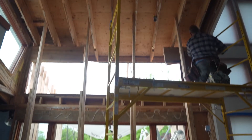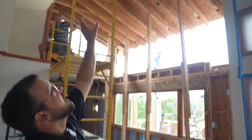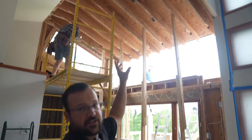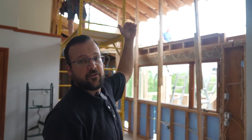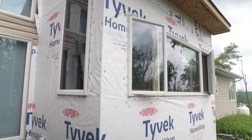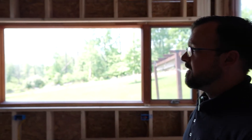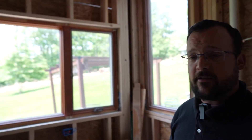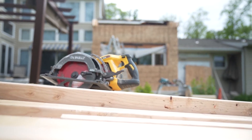Inside here we're going with 2x12s on the back pitch — existing is 2x10s. Part of that is we're going to be putting collar ties in. This small section of flat ceiling has small 2x4 collar ties; we're upgrading those to 2x6 or 2x8, and they should be a third down from the peak, so that ceiling is going to flatten out and come down about a third of what we're seeing here. We were able to repurpose the client's windows — he had a double window unit, we split that in half, separated the two units, and repurposed them one on either side of the original planned window, so he's got taller windows, better light, and it matches the original window on the back wall.